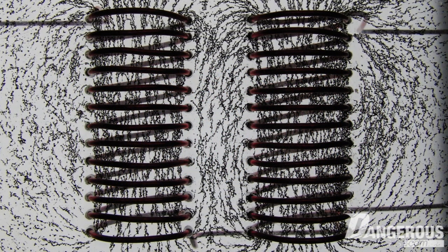Here we can see two magnetic coils that are coupled with each other. One coil emits an electromagnetic field, and the other coil inducts power from it. This is how an RFID reader and magnetically coupled tag work together to pass power and data over a shared magnetic field.